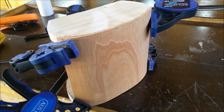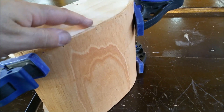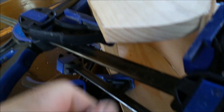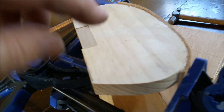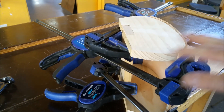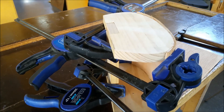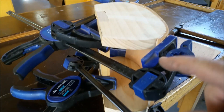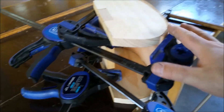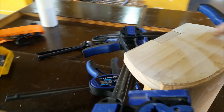We've made part of our form — the idea is we get the acrylic, put it in the oven, make it nice and floppy and just wrap it around here. This is bendy ply so it bends just that way but inadvertently breaks. We could have made a bunch of additional ribs but I didn't want the acrylic sinking between the two ribs. That's how they do it in coach building vehicles — a buck made from skeletal members, not only plywood, and that's how they form aluminium sheet and mild steel. Being acrylic in an oven it'll be quite floppy, so I don't want it falling between the ribs.